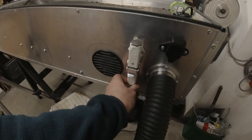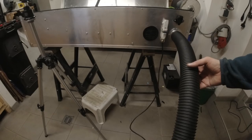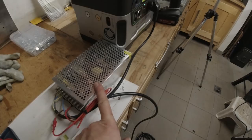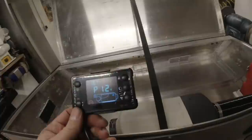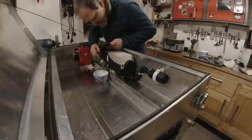There's my display unit which I can take into the tent, that's a heavy-duty connector, all watertight. Here's my power connector like from a tractor, where the 12 volts come in. Here comes the hot air out. We're ready to prime the pump — I've got to turn the AC on to provide 12 volts at higher amperage. I plug the cord into the outlet. If I've wired everything up correctly, the fuse shouldn't blow and the display should show something. To cycle the pump, you push these two buttons together with the pump disconnected so it doesn't flood the heater.